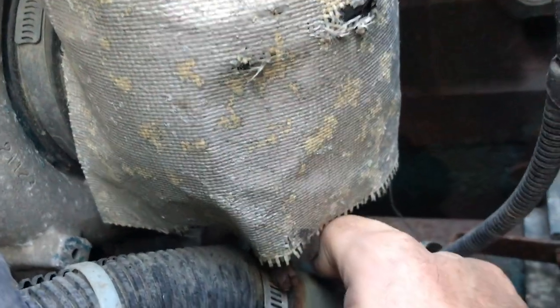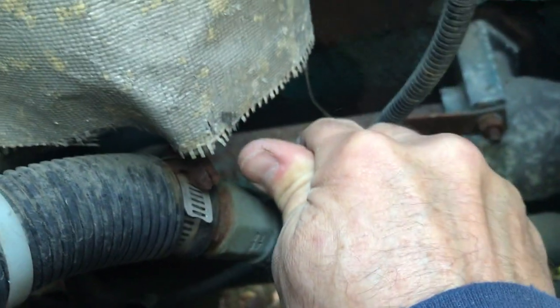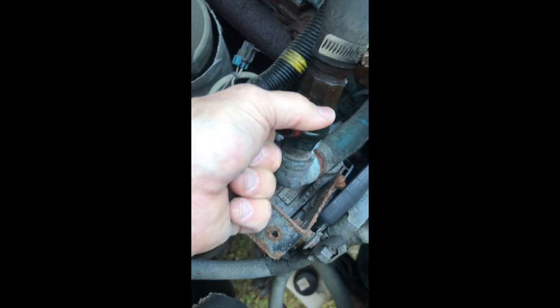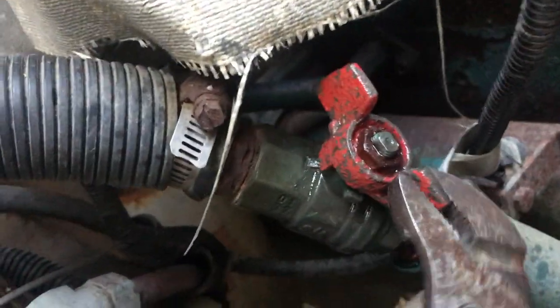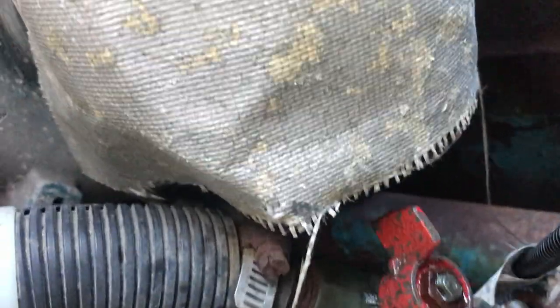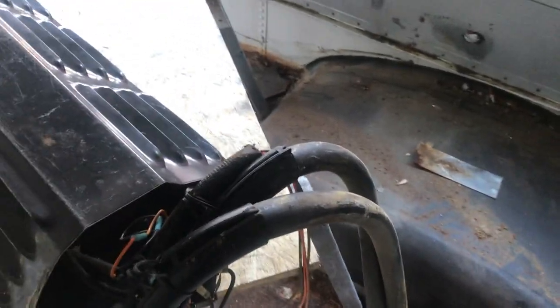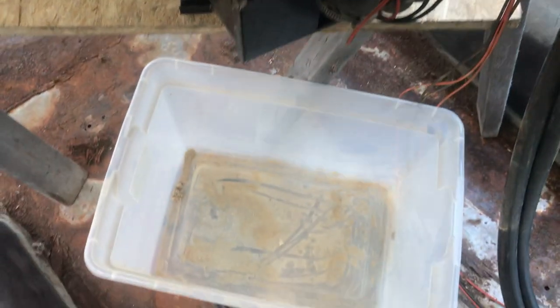The first thing I'm going to do is shut off the valves right here - the buses are in different places. I'll need two hands with that one and there's this one up there. I gotta shut both of those off. Sprayed this one with a little bit of PB Blaster - that tends to work a little bit better. Using some channel locks, get that one closed. I'll put the heater up on a little makeshift table here so it's elevated, which makes it easier to hold the fluid and coolant in the hoses.